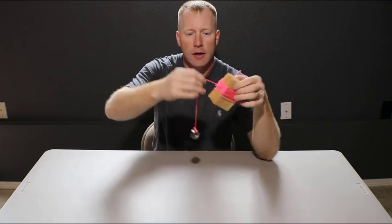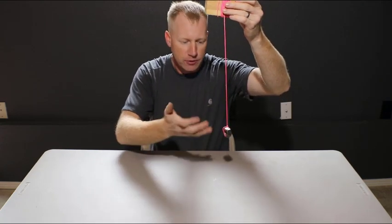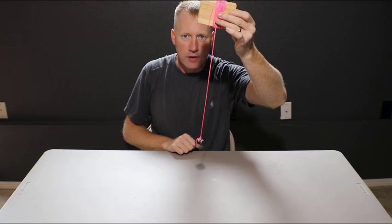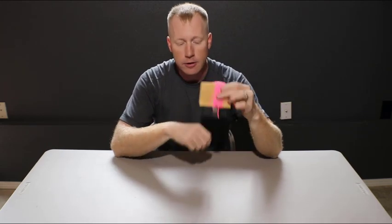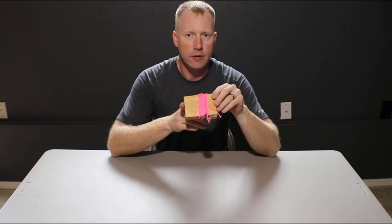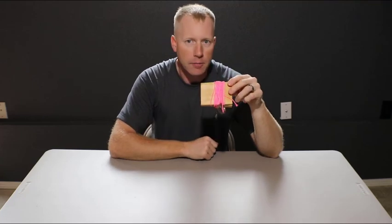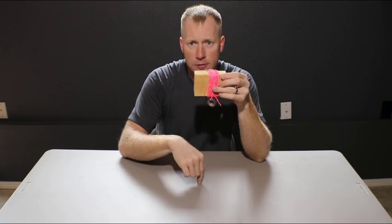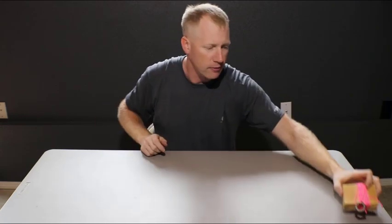This is honestly what you would need to plumb up a very tall wall or column. You put a nail into the side of it, hang your string from that nail, let the nut or weight stop moving, and then measure your distance at the top and bottom of the string. Adjust it until that measurement is equal and you know your column or wall is plumb. This right here could easily be job site trash you find laying around. With a nut or weight on the bottom you're not going to get a super precise point on the ground as with a conventional plumb bob, but it's definitely a good start.